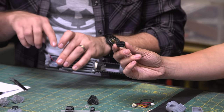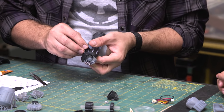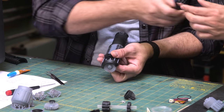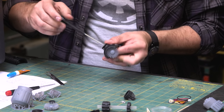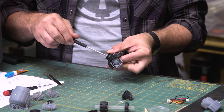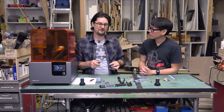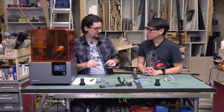and or screwed. So there's a hole in the back of the power cell. We're gonna line that up with the hole here. It goes right through. I want you to hand me that Allen key. Now, you do want to be very careful with this resin. You wanna get the sizing of the screws. This is a number 6 screw. You wanna get the sizing of the screws exactly right for the hole because you can crack the part otherwise.